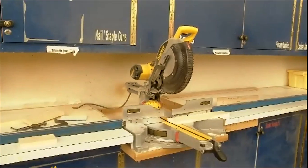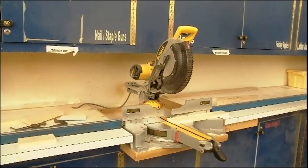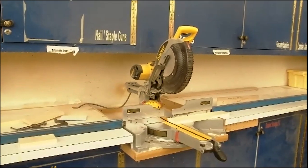And the feed mechanism that pushes your board through the machine is at a very specific speed as well. On our CNC routers, we control the rotational speed of the bit when we program the file that we're going to run on it. And the speed at which the router head moves through the material is also controlled by the program that runs the machine. So the quality of cut on our CNCs is very easily controlled, right?